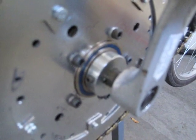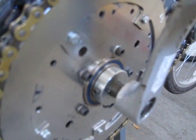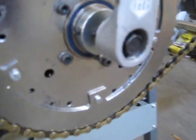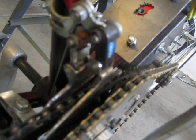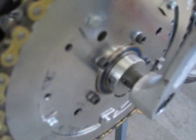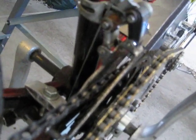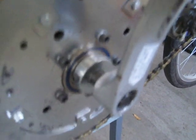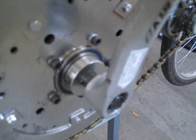The reason I'm not using the freewheel crank is that with the freewheel crank I had before, it would never seat correctly on the square spindle. Because of that, the sprockets would sway side to side, and there was so much movement that it kept knocking the chain off. That's why I switched to this system. Now I have almost no side-to-side movement and no wobble anymore. And if I need to take the crank off for maintenance, it's not going to affect this at all.